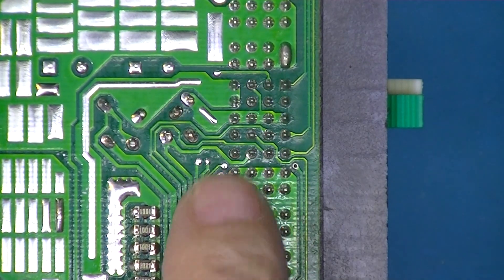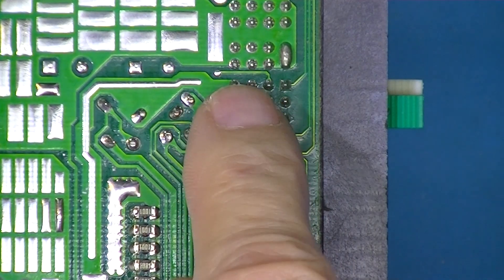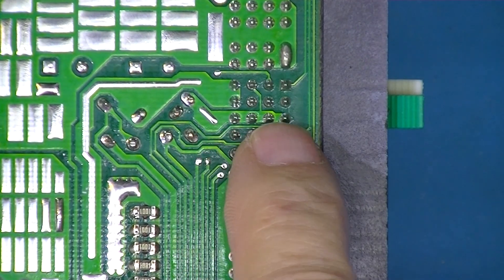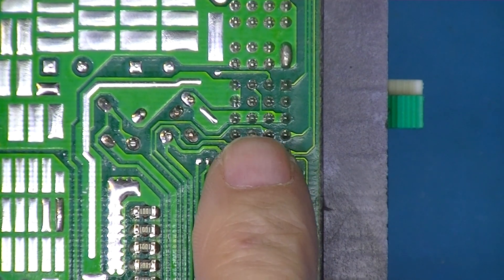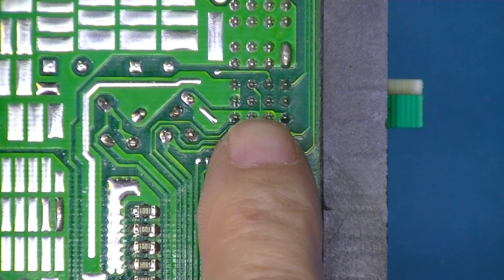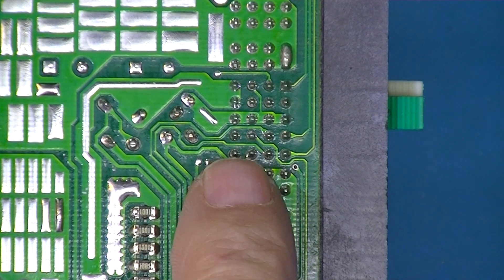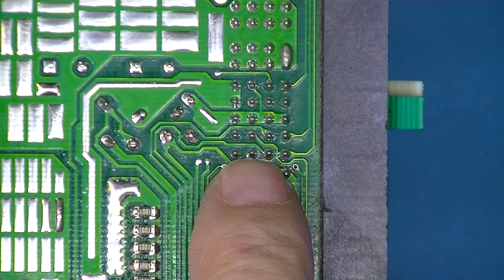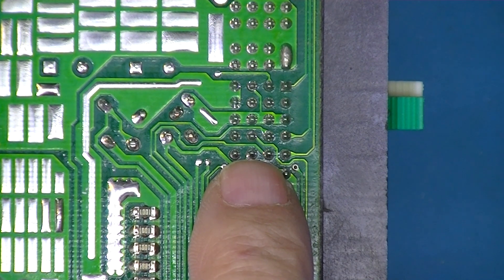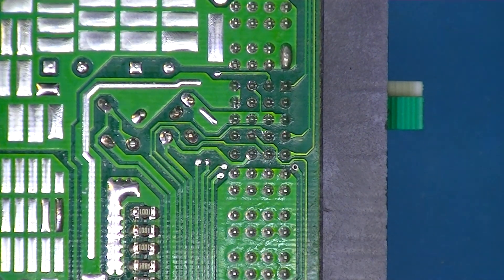Here's a close-up: there are four rows of pins with five pins in each row. These columns are clearly ground pins, and there's one little tiny ground trace tracing to this pin, so it's included in the grounds. It doesn't look like any of the other pins are grounded.